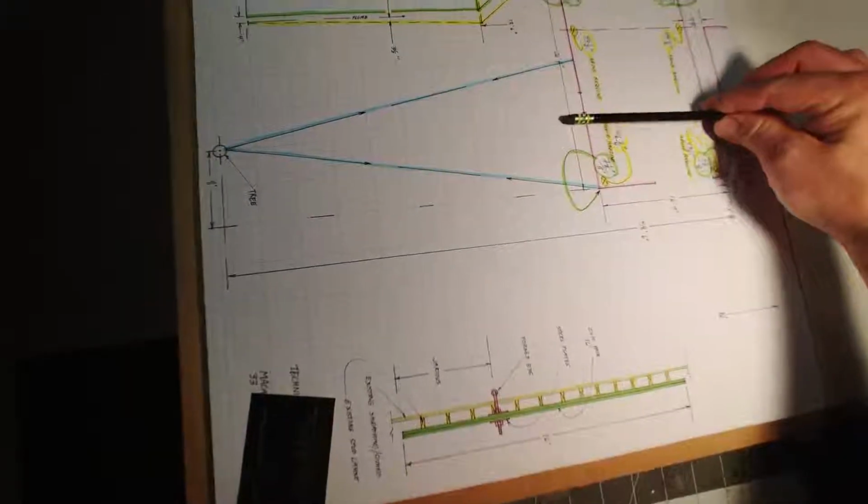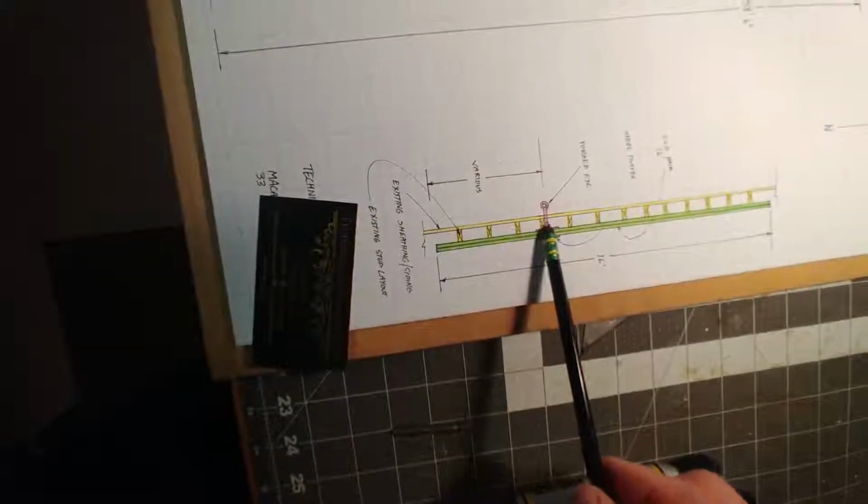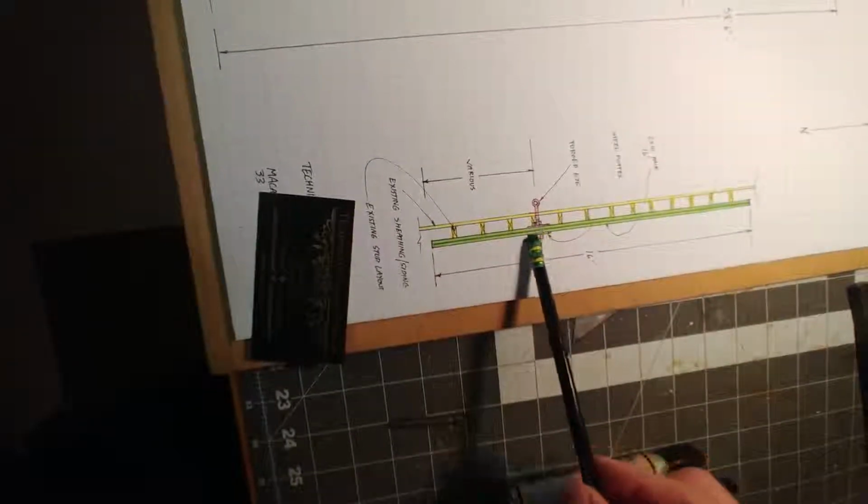And then I would come outside and drill in various locations where I felt it was necessary along here to pull toward the tree, and drill in, and then we'll slide a forged lift eye through there, and we'll just sandwich some steel plate on either side of this thing, and we'll get a threaded lift eye so we can tighten the nut down on this side and that side and just create a nice sandwich here.